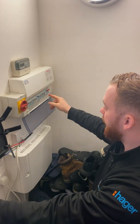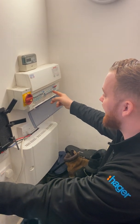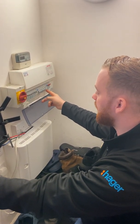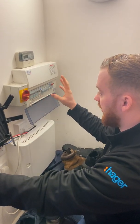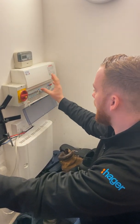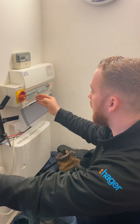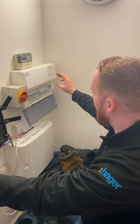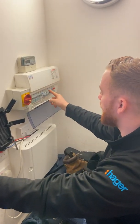One way you can do it is to turn off all the circuit breakers on the left-hand side of the RCD — that RCD would control those circuits. Many consumer units will work the other way, so you'll have a main switch and then an RCD controlling the right-hand side circuits. You can then try to reset the RCD with those circuits turned off.